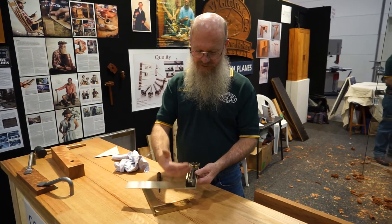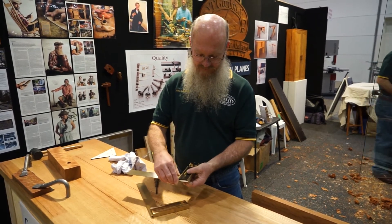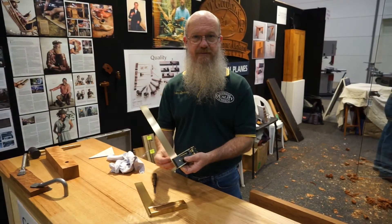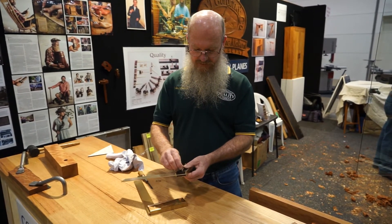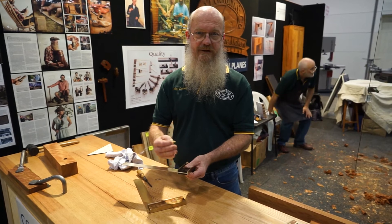Now I'll push the blade into the square handle — you'll see there's a rebate inside that pin. I'm pushing from the back towards the front. In tool making you would always push a pin towards the maker's mark, or where the maker's mark represents the top of the tool. You can see the rebate in that pin — that's the reason you have to push the blade back into the square.